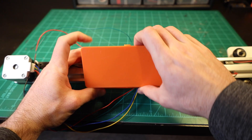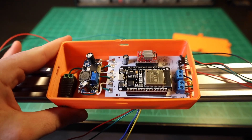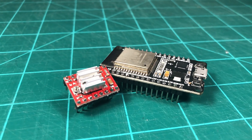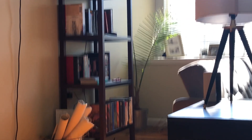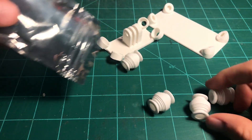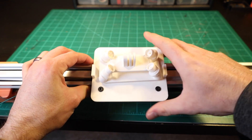The last and probably biggest problem I had with Mark 1 was that I built it using A4988 stepper motor drivers, which are usually great for things like 3D printers or CNC machines, but in this particular use case they caused way too much vibration that was clearly visible in any videos I recorded on it. I tried to get around this by adding some shock absorption pads to the phone mount but it didn't quite work as well as I had hoped, and since I'm using an actual camera now that solution won't work anymore anyways.